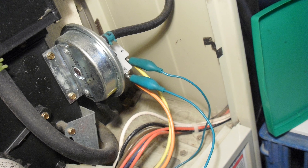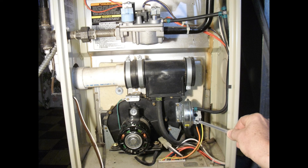You're familiar with what the igniter looks like when it comes to full brightness. But this time, we're going to recycle the furnace and we're going to jump across the two contacts on the micro switch, which is mounted to the air pressure diaphragm. We're only going to jump it after the igniter has reached full glowing intensity. This will cause the furnace to ask for gas and your furnace should start. You can leave that jumper wire on there while the thermostat is calling for heat. Once it stops calling for heat, disconnect the jumper wire. This is only a temporary thing to do. Let the house heat up for a while and then turn the power off to the furnace.